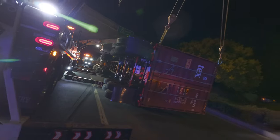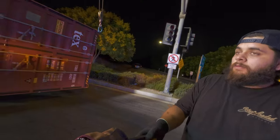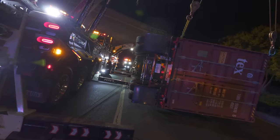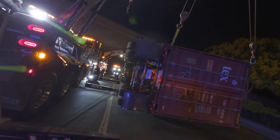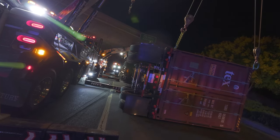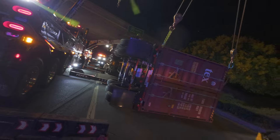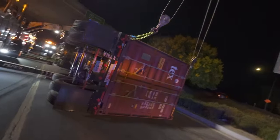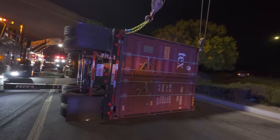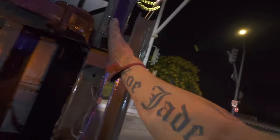All right, I think we should be fine right there. We'll lift up our outriggers, de-rig, and then square up with the truck. We'll square your truck first. Go ahead and lower it. Kick it out, so go ahead and boom out. Okay, go ahead and boom down now. That's fine right there. We have enough room on the opposite side. Let me go up there and de-rig you. You'll swing, and then we'll back up. We're going to put the middle of the boom directly right here. Back up where you're in line with this, okay?